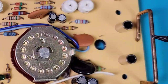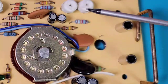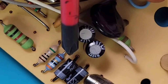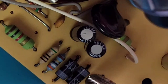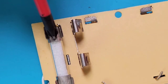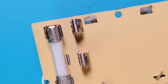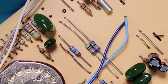On the opposite side of the PCB there is our big current shunt. There's no high current fuse on this meter — just this current shunt handling all the juice. We have TR1 and TR2, which are calibration pots for user calibration — TR1 for DC voltage and TR2 for AC voltage. Over here we have a couple of Schottky diodes, the 1SS97s — no longer in production — part of the circuitry for the high current input. There's the piezo giving us all that beeping. At the top of the meter we have our milliamp fuse — 200 milliamp rated on the meter, though Beckman actually included a 500 milliamp fuse.